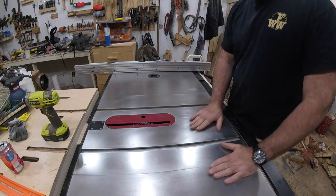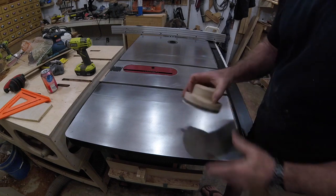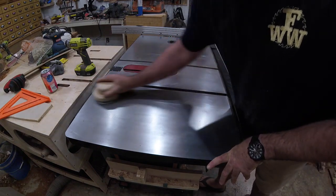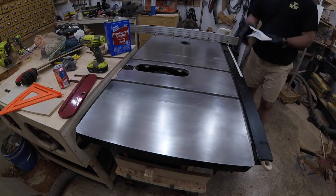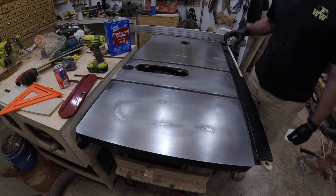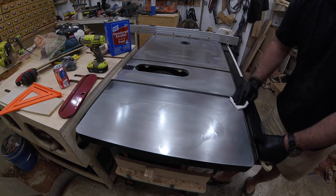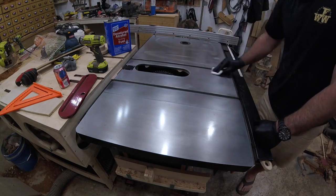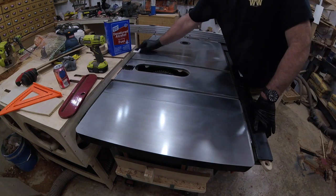I want to show you how I apply it. I take 600-grit sandpaper and lightly run it over the surface just to take off any foreign matter that makes the surface uneven, like drops of glue or finish. Then I clean it thoroughly with a paper towel and xylene or denatured alcohol, going over it a couple of times until the paper towel stays relatively clean. I spray a little bit of the Fluid Film on each section — this stuff is kind of thick. Using a clean paper towel, I evenly spread it out, covering the whole surface of the saw. Then immediately I take a clean paper towel and wipe away any excess. I tend to do this when I'm finished working for the day, so I can let it dry overnight. And that's it.